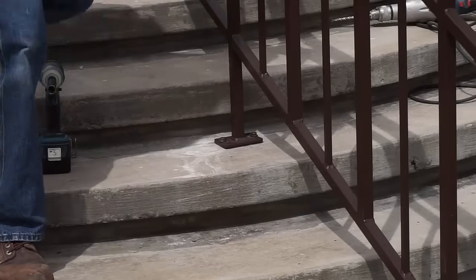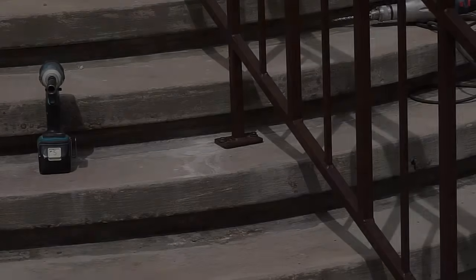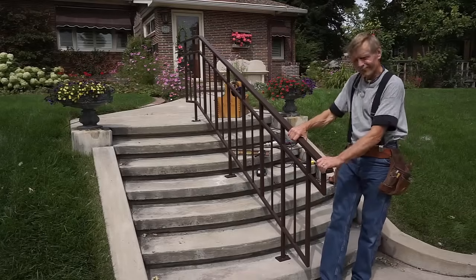You'll notice that I wiggled the bolt and started it back in to engage the threads that the bolt cut the first time, just like you would do with any standard machine bolt. And you can tell by the ring of the railing how solid that's anchored down. The best thing about these large diameter Tapcons is that it's drill, drive, done. Sweet.